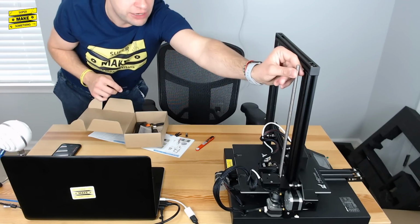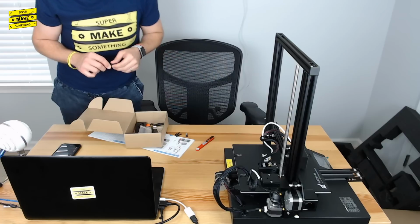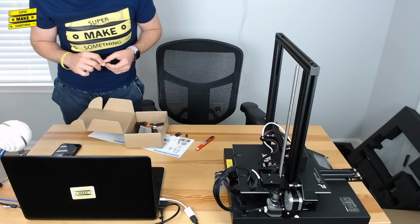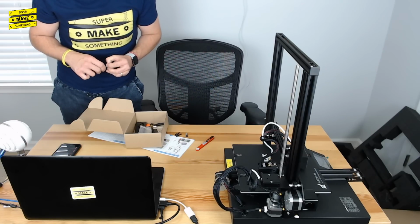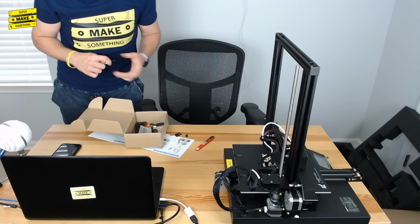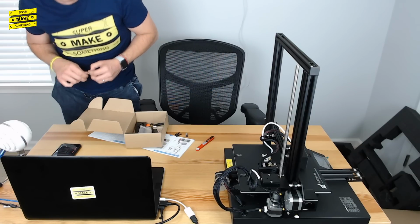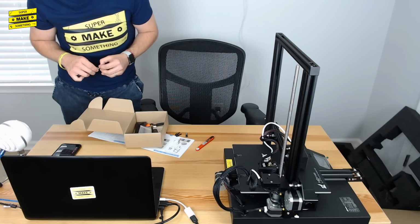I also noticed that there's no top bearing though to constrain this axis. So wondering if that'll introduce any wobble. Certainly something that we're going to test out here shortly. But yeah, kind of a clever design just because going single motor in the Z-axis as opposed to dual motor is certainly something that keeps the cost down and makes printers both cheaper to manufacture but then also cheaper to ship. So that brings down the overall cost of these printers. So that's kind of a nice thing, to try to make it easy and affordable for people to try their hand at their first 3D printer.